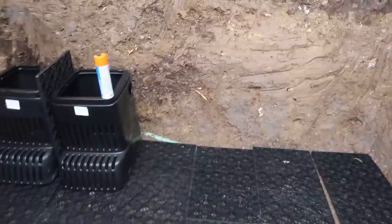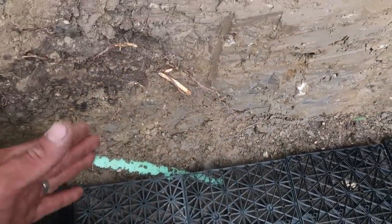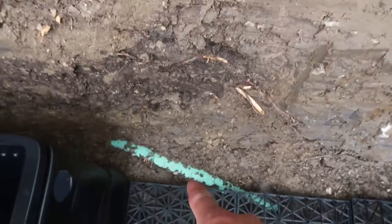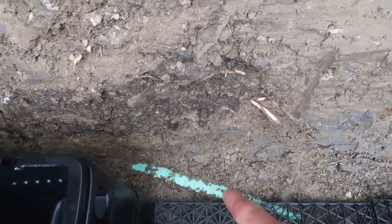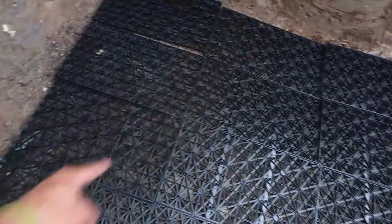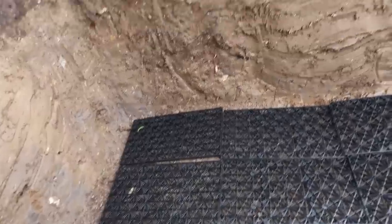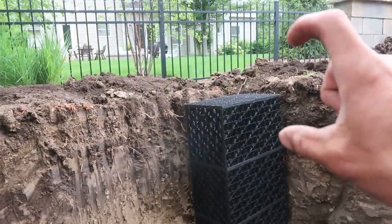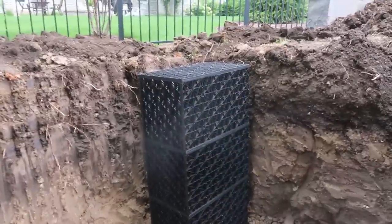We're going to put a small bedding layer of sand on just to level things out down here, but this pipe dictated how deep we could go because we didn't want to dig out or move our reservoir over. We could only go to the top of this pipe because I did not want to relocate this at all. So that actually established our elevation. So it's forcing us. Ideally, we wanted to go about 6 inches deeper than where we're currently at, but because this pipe runs right through that corner of our reservoir, we can't go any deeper there, and I didn't want to sacrifice on volume. So what we're going to do is, elevation's worked out, we're going to add 6 to 8 inches of soil on that backhand side, and then that will be just a nice gentle overflow area.